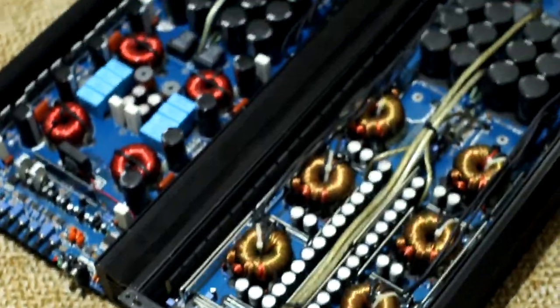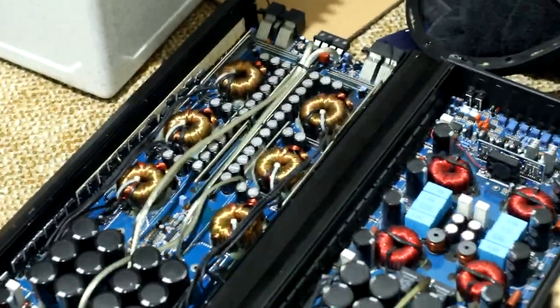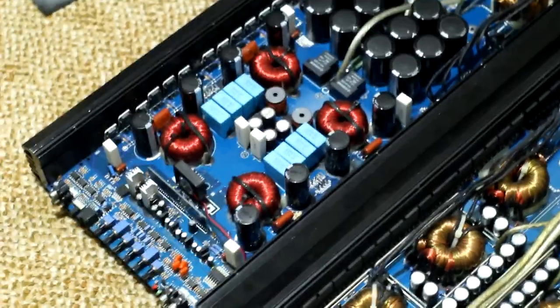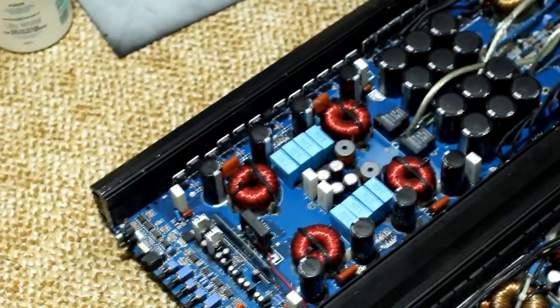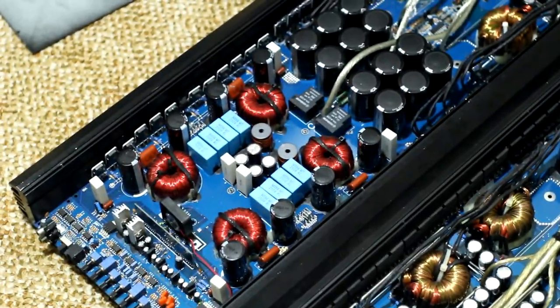So these two son of a bitches on the floor here, these are the bigger variations. As you can see, the power supply runs 6 push-pull transformer sets, and the output section is 4 amplifiers in parallel. So you've got 4 IRS21844S drive ICs, which are in their own right driving a half bridge amplifier, and there's 4 half bridge amplifiers that then all parallel together on the output section after the inductors. So this is the bigger of the Zenon 8K boards that we have here.